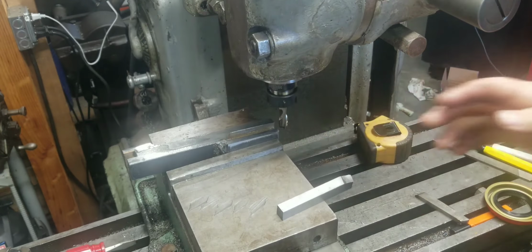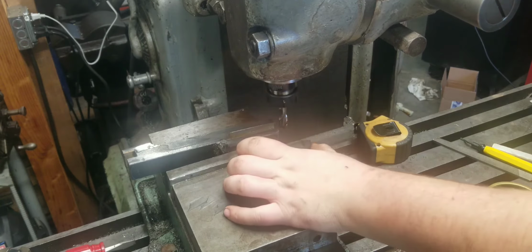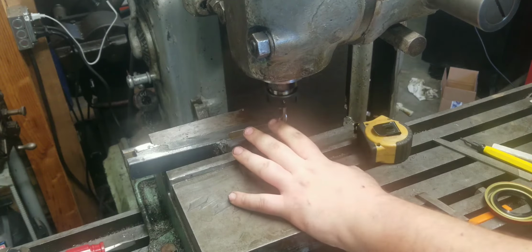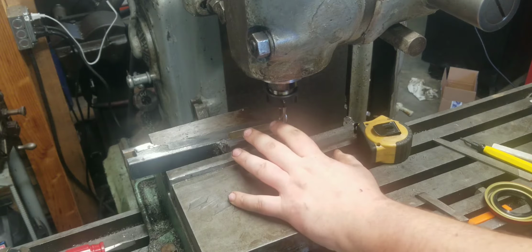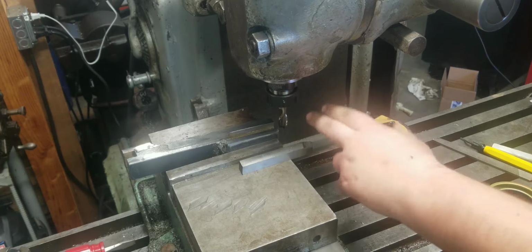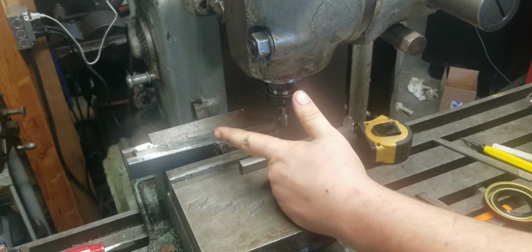It needs to be about an eighth inch deeper. Now I might notice it's a bit cocked in the vise. I want my tools, whenever they sit down in there, to sort of point, to have a little bit more relief than they would if it were flat. Now this isn't all that important for carbide inserted tooling, because I can always just make my holders, or use lathe tool holders that have the tool sticking out a little bit more, where it doesn't matter as much if you have a little bit of a rake angle here.